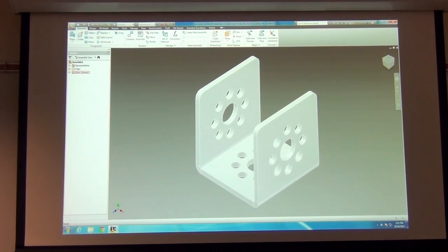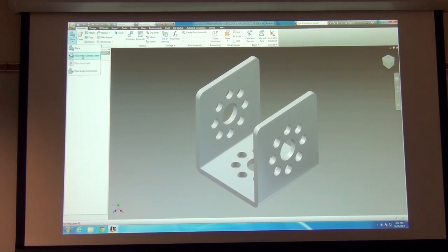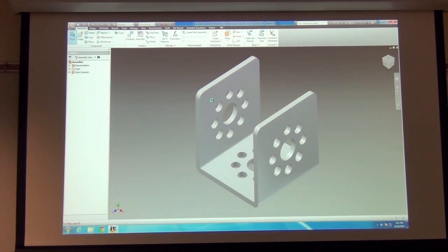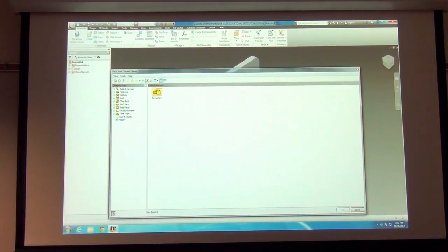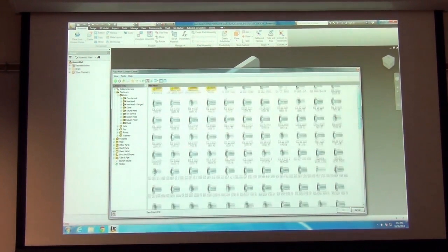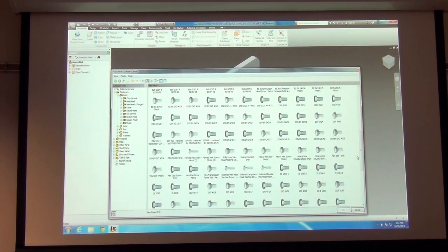So those are bolts. What I want to show you is how to do connections between parts. Let me place another component in here — let's do two of those channels. Let's say I want to fix these parts in space and I want them to relate to one another so they match. To decide what orientation each part needs to have: if you're doing the chassis for your robot, you may want longer pieces attached to shorter pieces, with a specific connection method. To get parts to mate with each other, up at the top notice you have the Constrain tool. Click to open that — there really only is about one or two settings in this tool, but they make it look harder than it actually is.